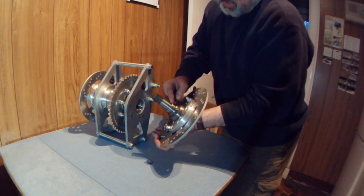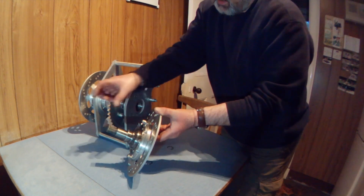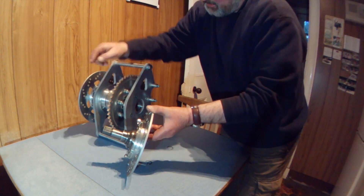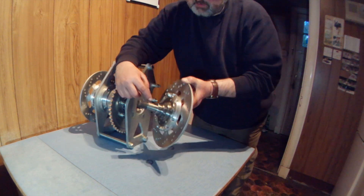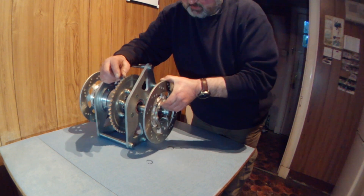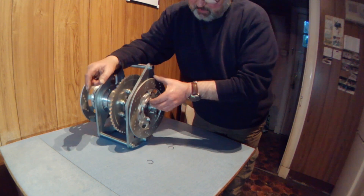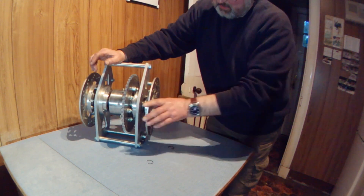These have been shimmed up as well. Normally there's a little bit of end float between the spline clip and the gears inside, and we want to minimize that because we're using the disc brake. So there's a shim bonded onto the face there that removes the worst of the end float. And with the outer bearing, they run fairly true and don't deflect too much.